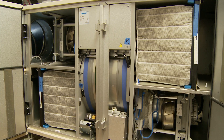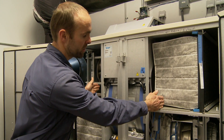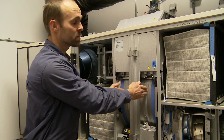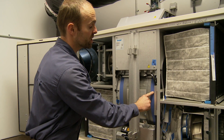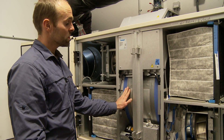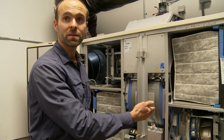This is a continuous ventilation heat recovery ventilator. It has pressure sensors on either side that can detect when frost is collecting on it. What it'll do is actually slow down the rotation of the heat recovery heat exchanger. Instead of shutting down, it reduces its own efficiency in terms of heat recovery, but it maintains ventilation — that's its method of frost protection.